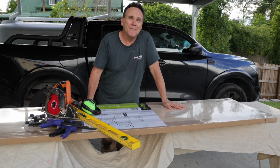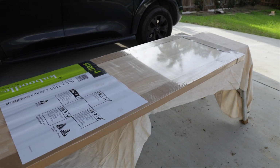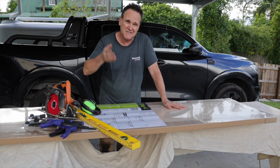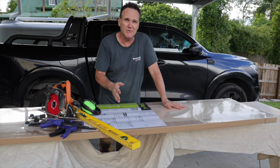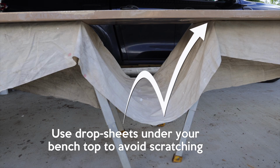Two things to bear in mind when you're cutting material like this. It's really heavy, so you don't want the cut end dropping off. If it does, it'll rip the bit that you're trying to retain. What you need to do is support each end. I've done that on 2 work platforms and then left a gap in the middle.